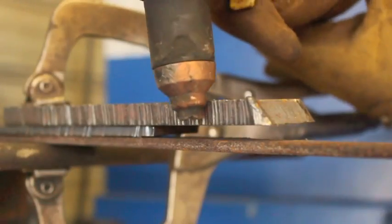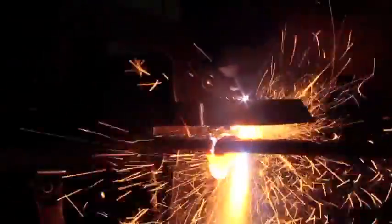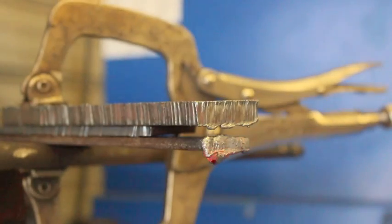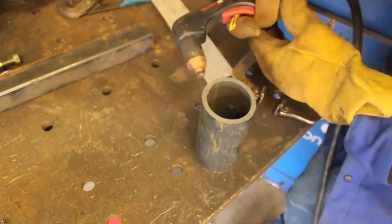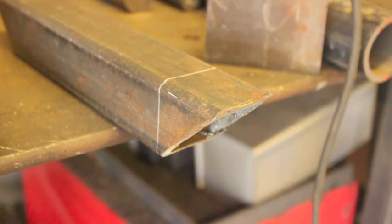Now there are some other advantages to using a plasma cutter over other thermal cutting methods, like an oxy-fuel torch. Here I've got some stacked material with a gap in it — which still isn't a problem for this awesome machine. We're slicing through 3/8-inch flat stock, then there's a 3/16-inch gap, then more 3/16-inch flat stock, and it's not an issue in any way, shape or form. You can also cut through large and small round objects with this very easily, as long as you give yourself a nice line. Now there are some downsides to the plasma cutting process. For instance, if you're going to cut something like a piece of square tube, rectangular tube, or channel, in pretty much every case you'll have to cut individual sides individually. But since the plasma torch is so light and easy to maneuver and you can see what you're doing, it's really not that hard.